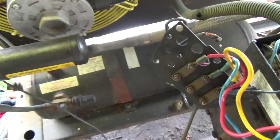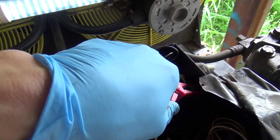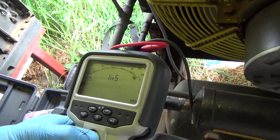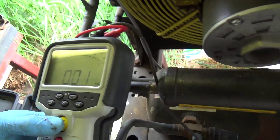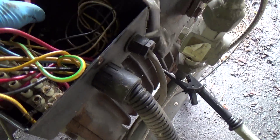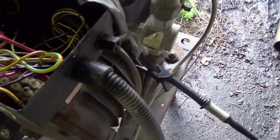We've got the megger set up. We've got that on the liquid line. We need to find another earth — let's try that screw there. I'm getting a dead short, so we know the connection here is good. It's no good testing for shorts if the earth connection isn't touching.